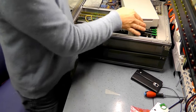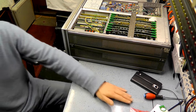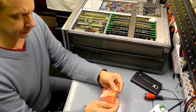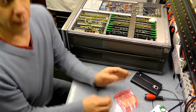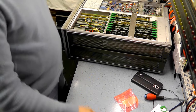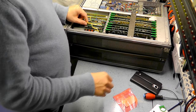I'm going to change the final relay in the 3562 tonight. The relay turned out to be this tiny little thing — it's a tiny little reed relay, single pole, single throw, normally open. So let's get that done this evening.